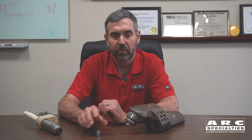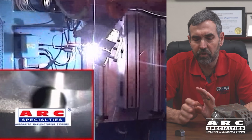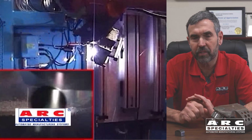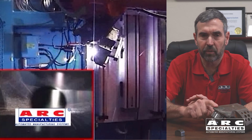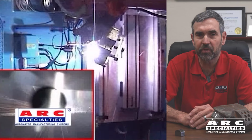So we're able to compare the old traditional atomic hydrogen oxyacetylene applied agglomerated carbides in a steel matrix to our steel matrix agglomerated carbides, large diameter, to the new technology. And lo and behold, we were right. And not only did we have improved wear resistance, but we also facilitated the plasma welding of all of these parts. So it's all tungsten carbide, it's all in a matrix, but these subtle differences are what made the difference, and that's why these rock bits nowadays are welded with plasma, chrome nickel silicon boron matrix, and macrocrystalline carbide.